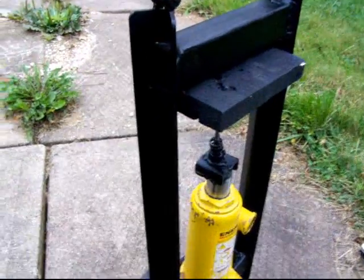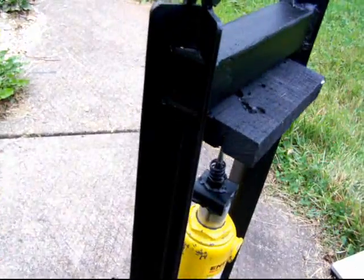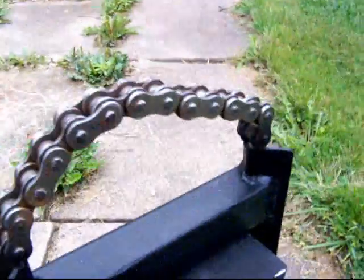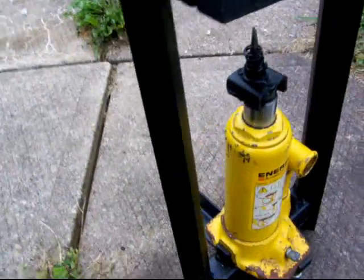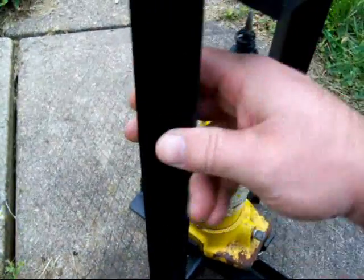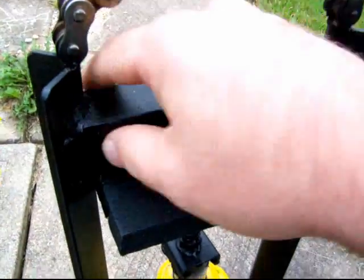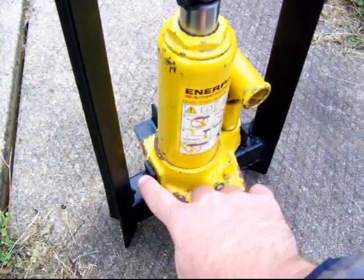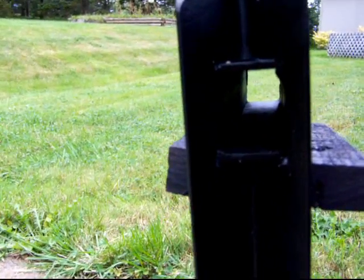Just before the payoff — look at the dead drive, woohoo! Wanted to give you a little look at what's holding this thing together. First of all, we have a nice motorbike chain handle. The frame, which is basically a rudimentary press, is made out of bed rail — little steel bed railing or bed frame. These horizontal pieces top and bottom are two pieces of angle boxed together to make that kind of shape for vertical strength.